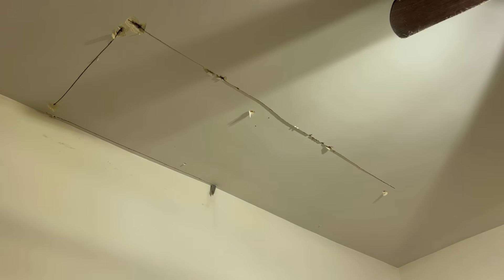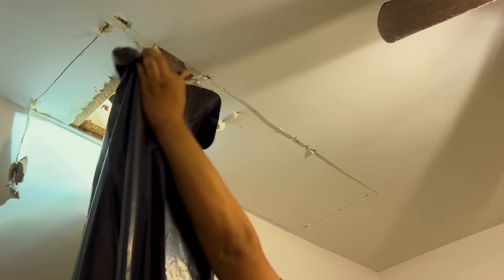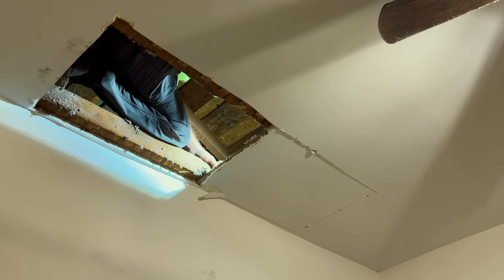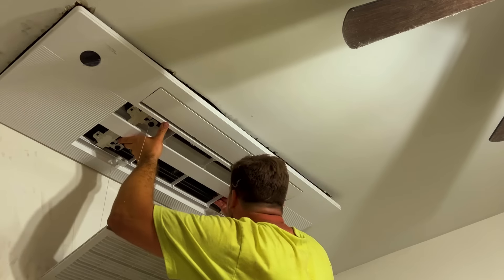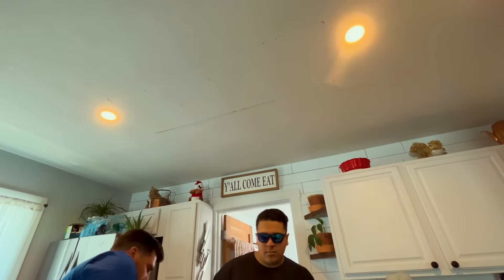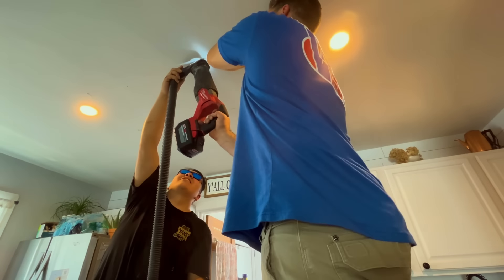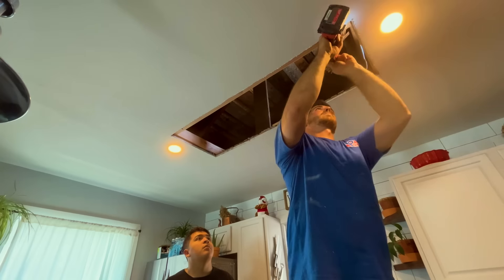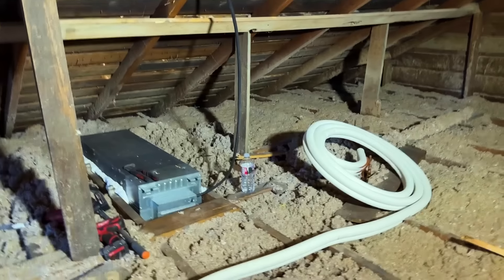We tried several approaches. For the second unit we cut from the attic with Terry holding the vacuum — much less messy. That section was lath and plaster, so I had to pull it off bit by bit, but we got a cleaner box with less cutting. For unit three this was the easiest: 24-inch center, so we cut the 17-by-51 square, removed the box as one piece, then framed in a new 16-inch center box to accept the head.